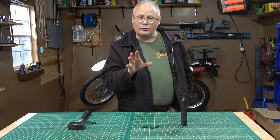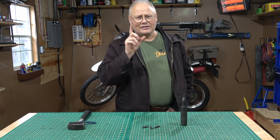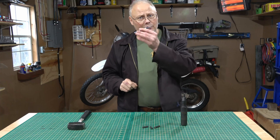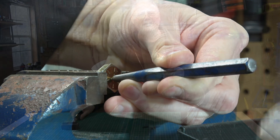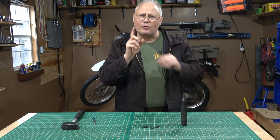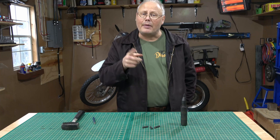Manual impact tools are by far the best value out there. The cheapest is a cold chisel or center punch that you probably already have in your toolbox. You place this on the head of the rusty fastener and give it some good strikes with a hammer, and oftentimes that's enough to break the adhesion of the rust and corrosion holding that fastener in place, allowing you to use a breaker bar to back it out.